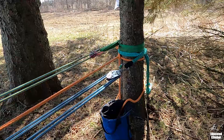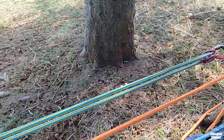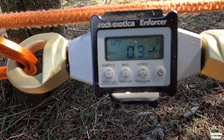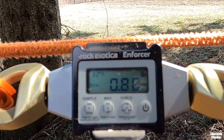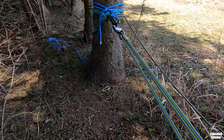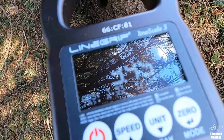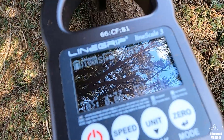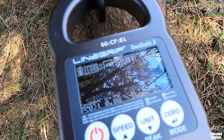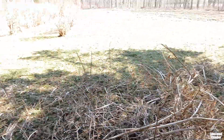Now I've moved the pulley to point B — the change of direction for the three-to-one. With an input of 0.90 kilonewtons, the output is fluctuating quite a bit, but I'll call it 3.4 kilonewtons.